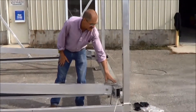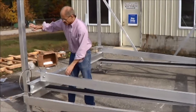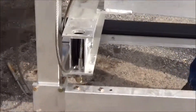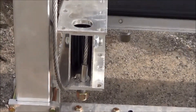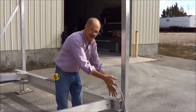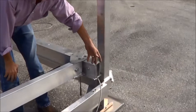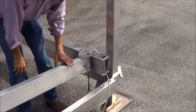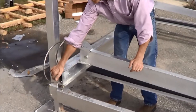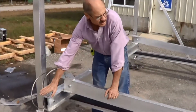I laid the twin beams — you've got the front twin beam and the rear twin beam on the left. The difference is that the rear twin beam has two pulleys, two sheaves in each end, and the front one has one. Also, you need to know that on the front, the stud end of the cable is going to be going up, bashing into the tube, so that's the direction this goes. These holes here are not drilled on the other side, so if you were to flip it around by mistake, there'd be no way to bolt the lower flange. It kind of forces you to bolt it up the right way.